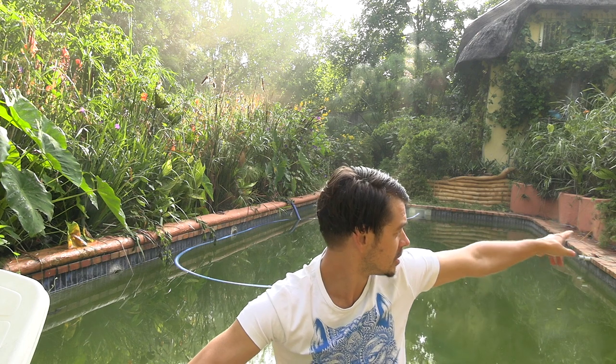Then I built wetland number two — this beautiful thing on the left-hand side, which is used when I top up the pool from the super adobe sandbag tank that catches water off my grass roof. The water from that tank is a bit funky because of the grass roof. So I push it through a black pipe to the first part of wetland number two. The first wetland started overflowing because I made two divisions — three little wetland cells — and as soon as the roots choke the two-inch pipe, the first wetland starts overflowing.